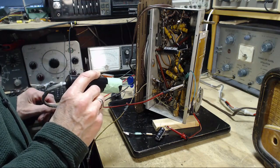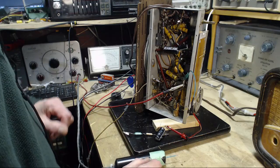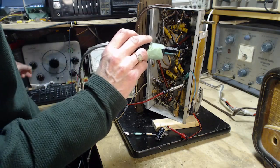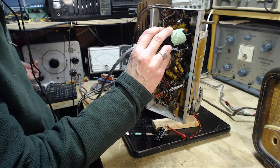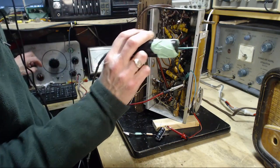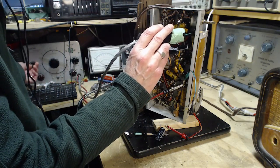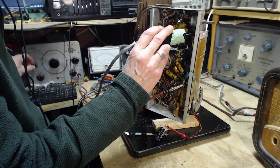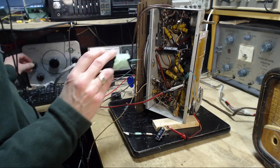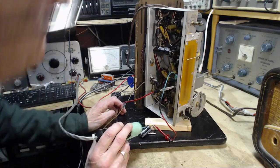What happened? Oh, I'm on phono. That's why I can't hear the radio. Okay. So again, that's a valid test then. If there's no hum there, let's try it again. No hum, no sound. It's just the signal tracer's own hum. No hum there. But on the output, I wouldn't say there's a hum there. Okay, let's keep going then. Keep following along, just what we were doing before.